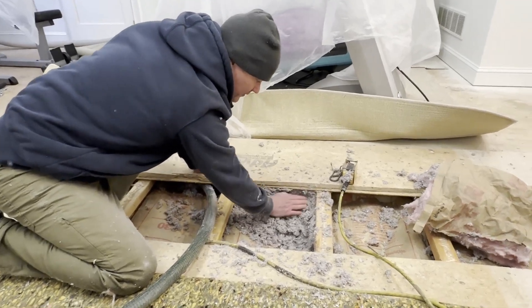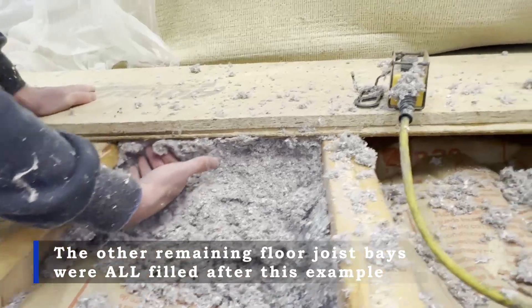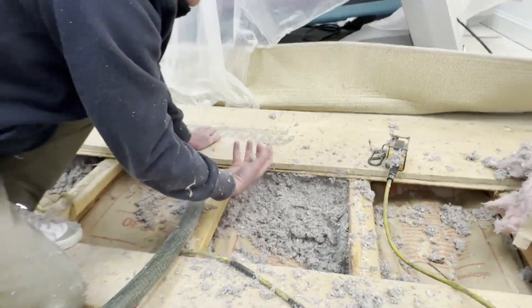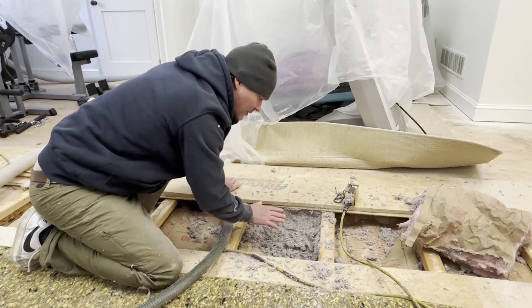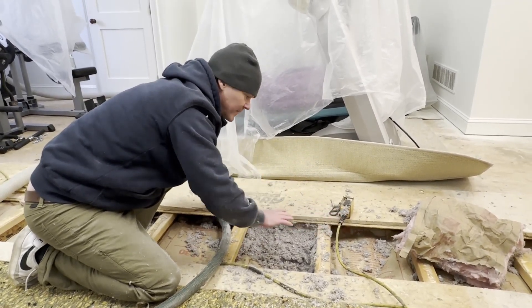There is no way for cold air to circulate beneath the floor going forward. Dense pack cellulose insulation will never settle, shrink, or crack. On cold winter days, this homeowner can now look forward to a much warmer floor as well as a more comfortable room. Now let's take a quick look at how the ceiling in the other garage came out after the InsulWise team filled the access holes with plaster.